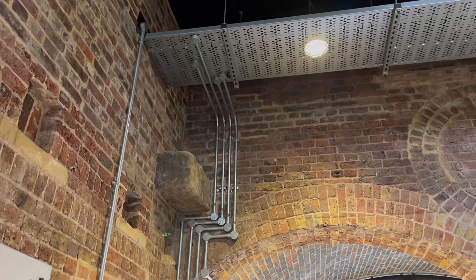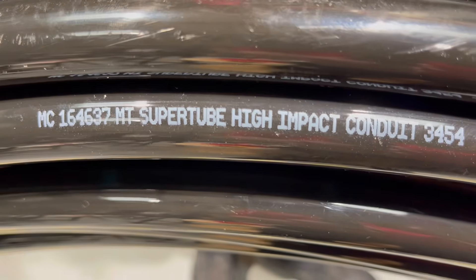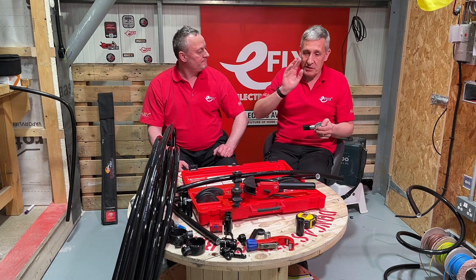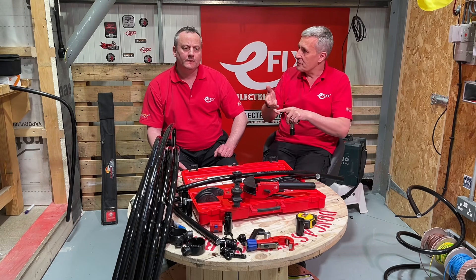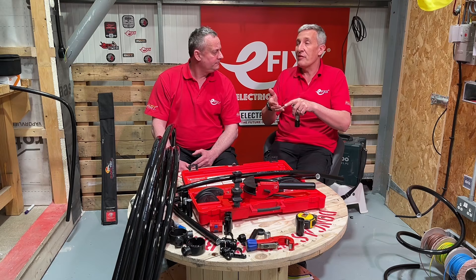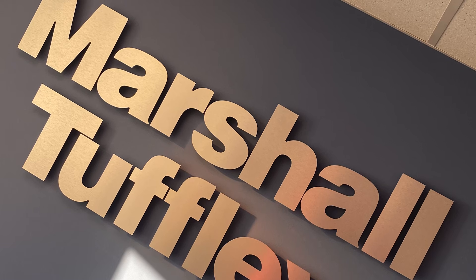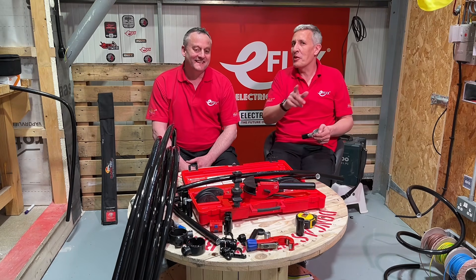The system comes in white and also in lengths. The 100-meter rolls follow a Henry Ford colour scheme — black only. Straight lengths come in white in regular conduit sizes: 20 or 25 millimetre. Conventional saddles and accessories work with it. Because you have fewer couplers and smoother bends, you'll need less materials — possibly fewer saddles than PVC but maybe a few more than metal. Marshall Tufflex has calculated that factoring in labour costs and material reduction, you can save 57.27% — not quite 58%, but not as low as 57.